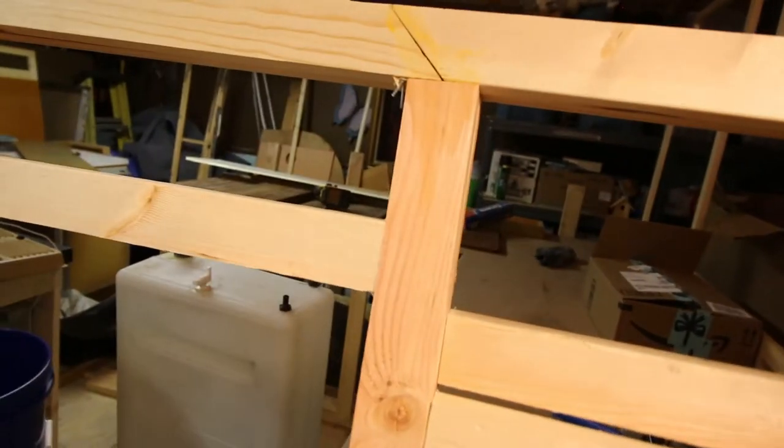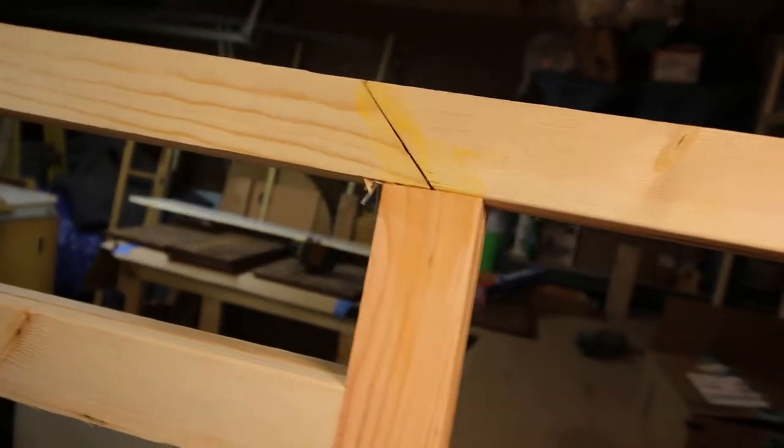The only other thing that took a little thought: the trailer is longer than the boards I could get my hands on that were straight, so I had to use an eight-foot board and splice it in. For that splice, you don't want to go flat end to end — there's no real good way to attach it except maybe pocket screws. So what we do is cut an angle in it, then glue it and let the glue set up for half an hour or an hour, come back and glue it again, put them together, and then nail them. The reason is end grain soaks up a lot of that glue and you won't get as good an attachment. Cutting an angle helps — ideally a steeper angle than I did, but that's what my miter saw cuts, so I went with a 45. It'll be in the middle of a panel and I'm secure with where it's at, so it'll be alright in the long run.